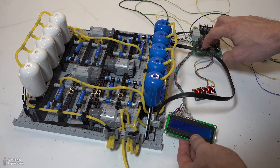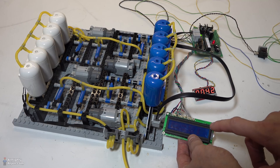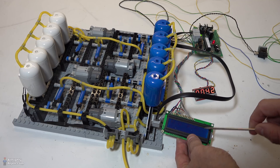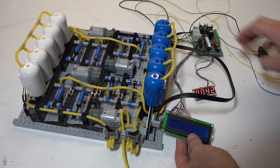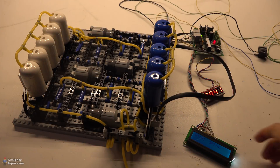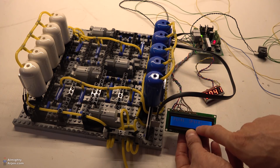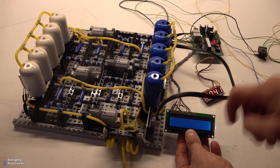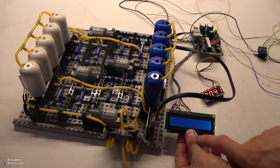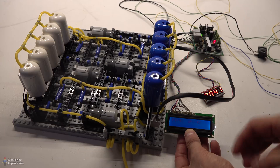The runtime you can actually see when I press this button here. Let me kill the light so you can see it. Now you see the pressure is 41 and the set point is 42. When I press this button you can see the runtime, which is still zero hours since the compressor is brand new.